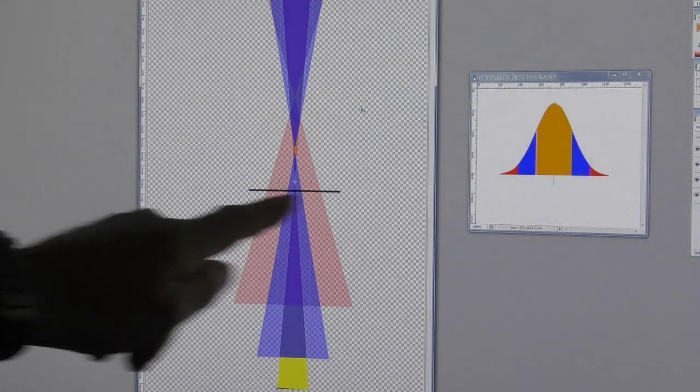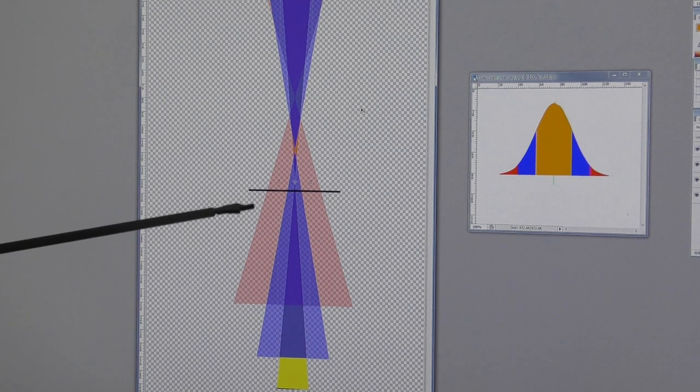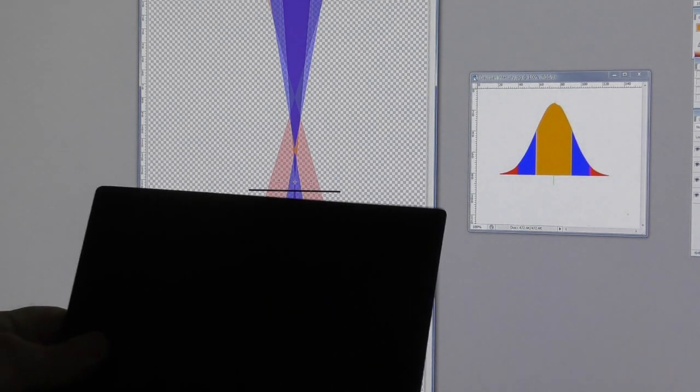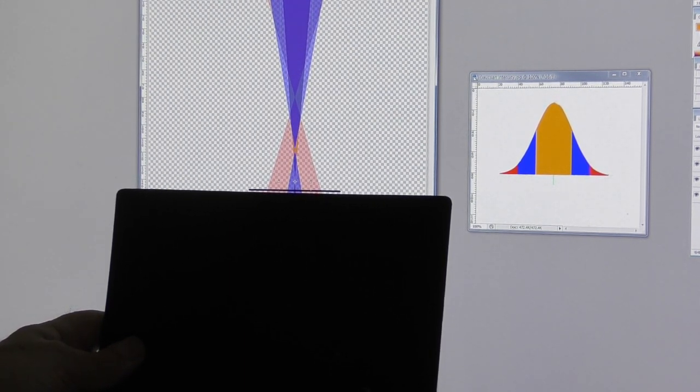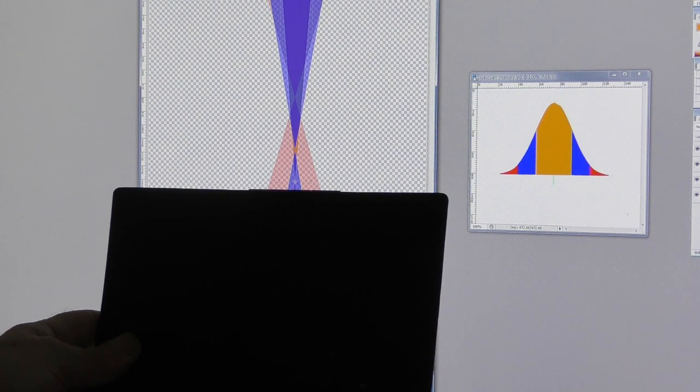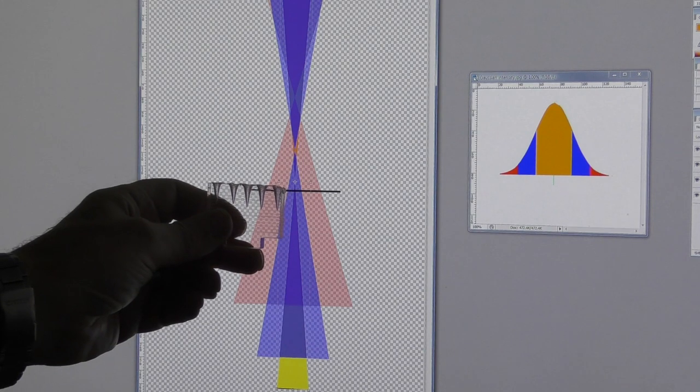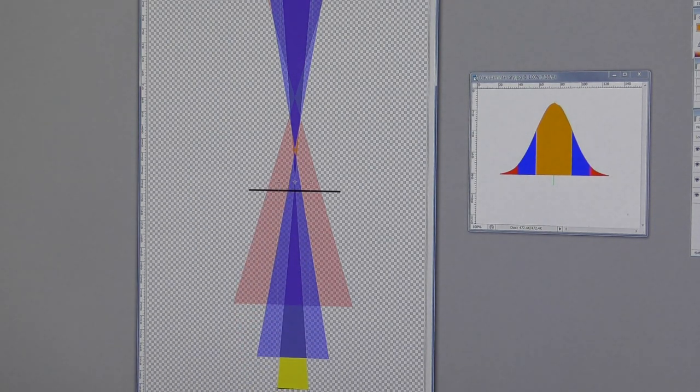The only thing that is certain in this diagram is that wherever the material surface is, that's where the beam is going to enter. What happens below the surface is of absolute zero importance, because it's what's happening at the entry point there, the wound, if you like, that's going to affect the shape of the hole. When the entry point is big, we're going to get a very slow and shallow penetration. So let's take a look at what's actually happening here.